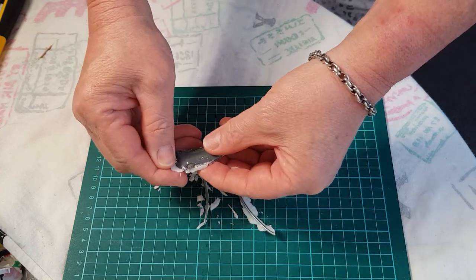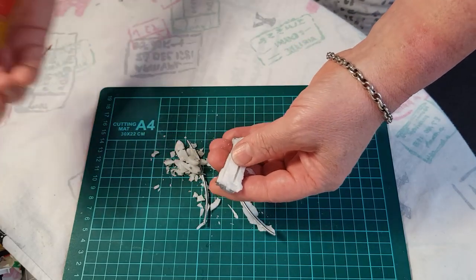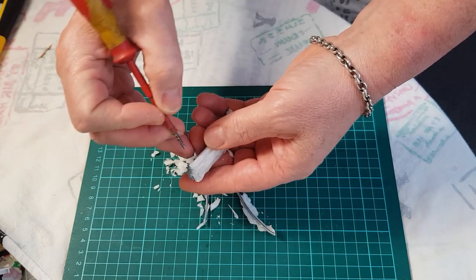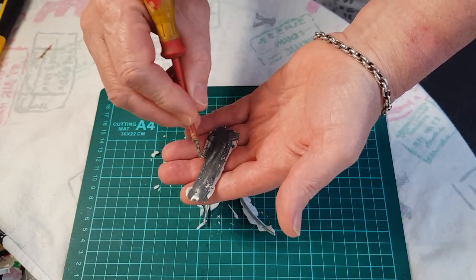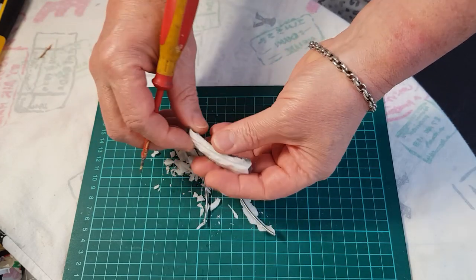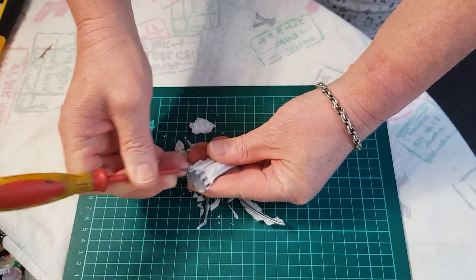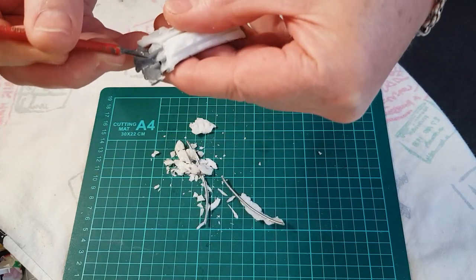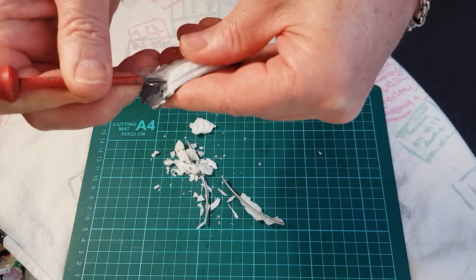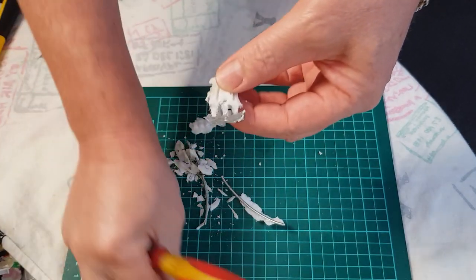I did think of maybe using some hot water to melt the wax. The problem I found with the JB Weld, even though it does stay very rigid, is that as soon as you put any heat on it, it tends to get flexible. So that would be no good for what we're trying to do. It would then ruin the shape. Really, there's a little bit of an air pocket in that one there. But we can fix that later, that's fine.